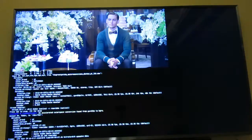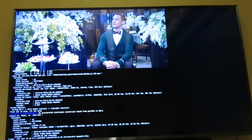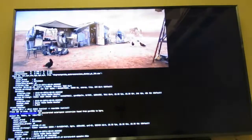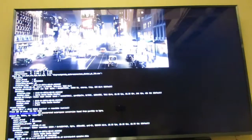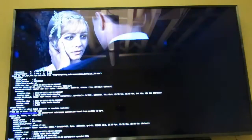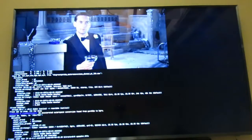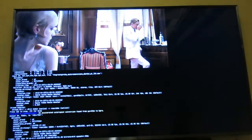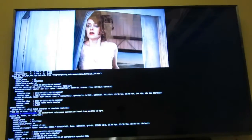So I wanted to start to demonstrate building an application from source code and then using it to play a video file directly to the display. But there are some issues. If you look closely, some of the output frames are torn. That means that the video data is being written to the frame buffer in an unsynchronized way compared to the output frame synchronization. I think this is one of the biggest challenges for an application that's decoding and outputting video in this way: how can it decode to a frame buffer and have the frame buffer be presented to the output HDMI interface in a clean way, at HEVC at 4K resolution at 60 frames per second, without any skipped or repeated frames or without tearing.